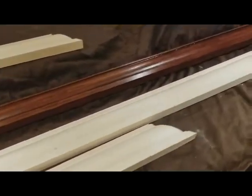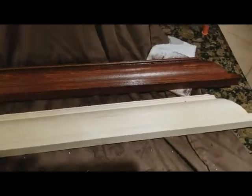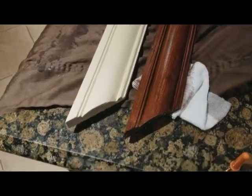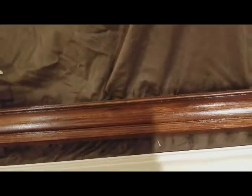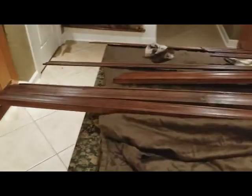My first piece is done and drying. The brush gives it a nice deep, thick coverage. The first time, if you use a cloth or sock it ends up wiping a lot off — that's one reason I prefer the brush method. With stain on a wood grain you're going to end up with some imperfections and inconsistencies, but just use gentle broad brush strokes and keep blending. It looks like it's more wet in the grooves, but I went in with the brush and smoothed it out so I'm confident it won't be too dark. I'll give it overnight to dry before I mess with it again.